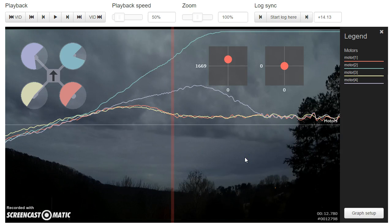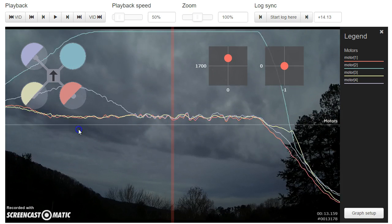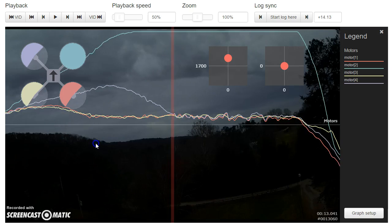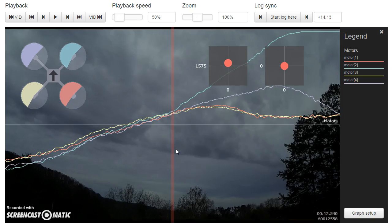So what's the takeaway? It's very important that your ESC endpoints be calibrated to your flight controller's throttle range. If there is a little bit of mismatch, the flight controller will be able to compensate with the PID loop, but if there's too much mismatch you're going to get this scenario where the flight controller can't figure out what's happening in time. They need to be calibrated. This is more of a problem with some ESCs than others — I've never run into this before, but Quad McFly tells me other people are having this issue with the LittleBee specifically.